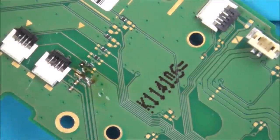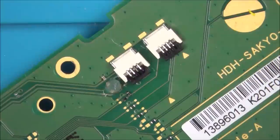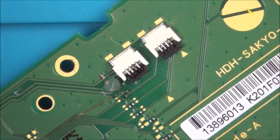Right, there should be solder on that now, so let's get some little enameled wire. And I'm just going to try to tin this up. This stuff here should be thick enough. So by putting the soldering iron up and down it, it should burn off the outer insulation, the enamel. Add a little bit more flux, I've just cleaned it as well. Trying to do this through the viewfinder, so I think I might be better off getting my microscope up.